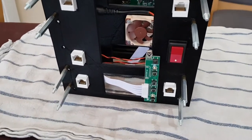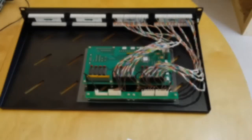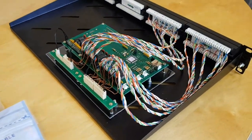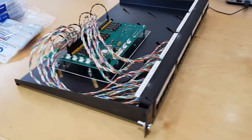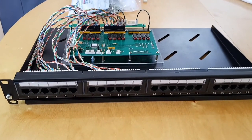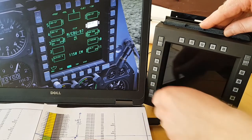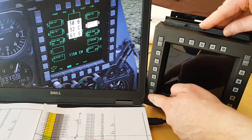With it now physically built, it's time to bring it online and interface it into the computer. I take the keyboard encoder and mount it into a cantilever shelf which will be part of my data cabinet — the main hub for the sim pit — and put all the wiring in place for both MFCDs. There are also a few spare inputs reserved for other parts of the front dash, and one third of the encoder is reserved for the up-front controller. I've noted down the keyboard bindings for each input, keyed that into the sim settings, programmed it on the encoder and tested that it's working properly.